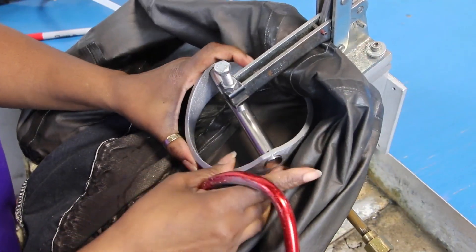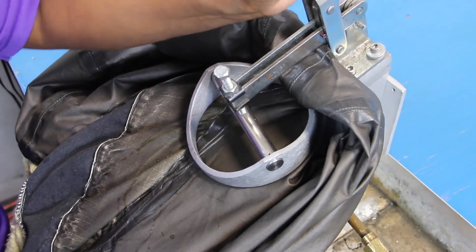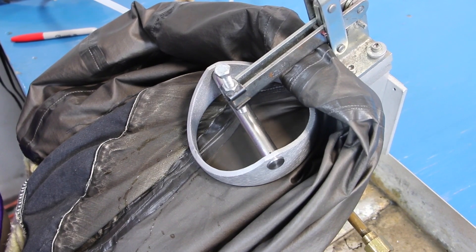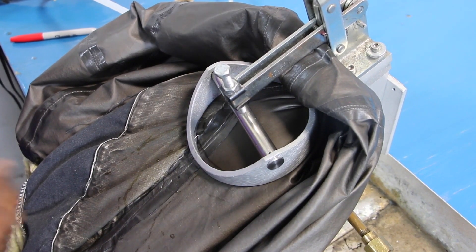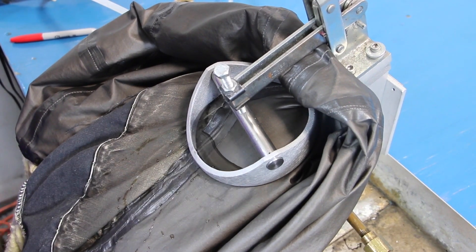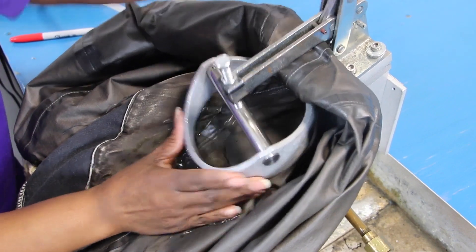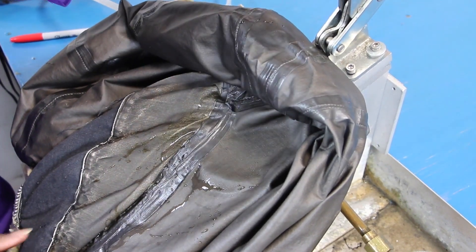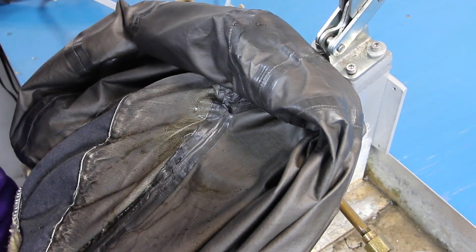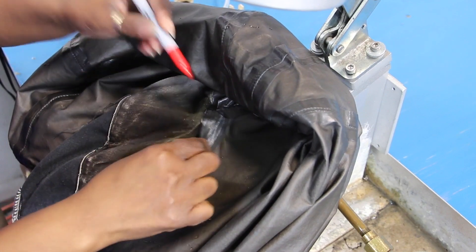You need to test the broadest parts of the shoulders, back waist area of the coat and the knees, crotch area, and seat area of the pants. If potential damage was detected through visual inspections of your turnout components, test the corresponding areas of the moisture barrier. If water penetrates through the film and to the substrate on any area of the moisture barrier, note the location on your inspection form. The garment needs to be sent to the manufacturer or a verified ISP for repair.